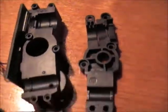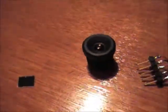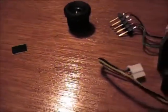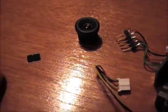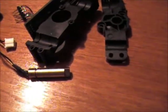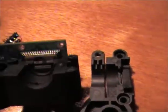When you look inside here, because they have the infrared laser, there's what's called a pass filter — this little square piece sitting right there. What it does is basically block visible light and allow a certain wavelength through, which is very close to what this laser wavelength is. Say it's 900 to 950 nanometers that this allows through, and maybe this is a 925 nanometer laser. It's only going to allow that range through and tries to block all visible light, which means this laser range finder will work as optimally as it can under all kinds of lighting conditions.